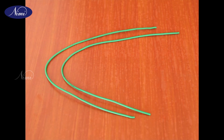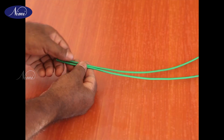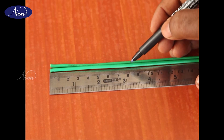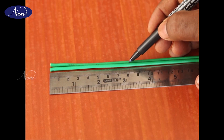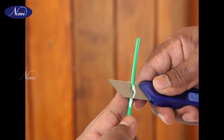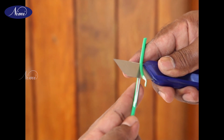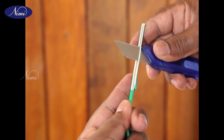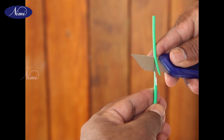Task 1: Make a straight twist joint. Step 1: Collect two pieces of 1 by 1.12 PVC copper cable of 0.5 meter length. Step 2: Straighten the cables. Step 3: Mark 80 millimeters length on one end of each piece of cable. Step 4: Use the knife at an angle of 20 degrees and remove the insulation from each conductor for a distance of 80 millimeters. Avoid nicks in the conductor.